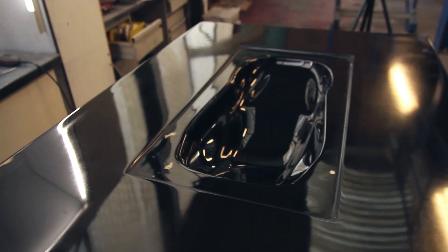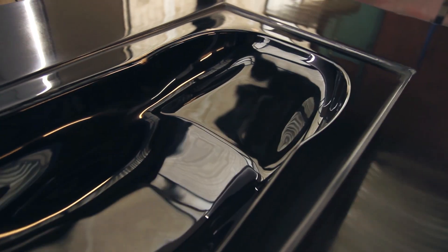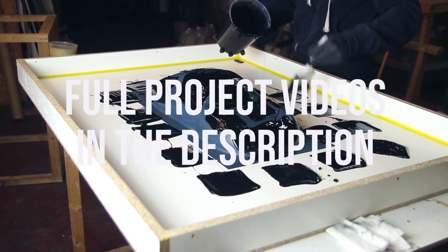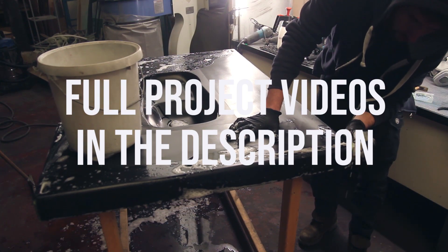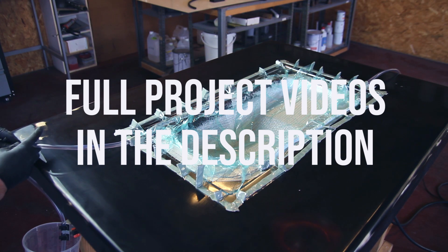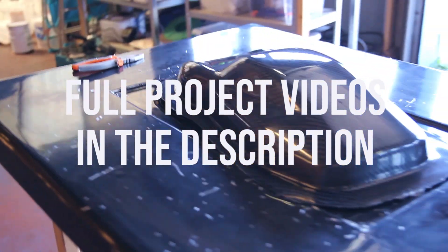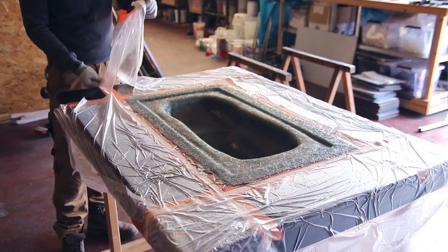This will be part of tutorials to come. I'll be making an RTM mold, which I wanted to cover separately. For upcoming videos, you can expect: finishing a master, making a mold, making the first part out of it, fixing the mold in other ways, and then finishing everything with the RTM molds to produce rapid parts with a good finish on both the inside and outside. Here you can see the carbon fiber and everything needed to finish the second mold half that will come on top.